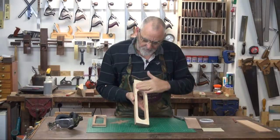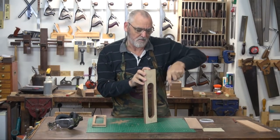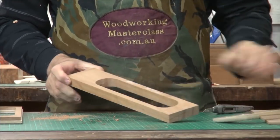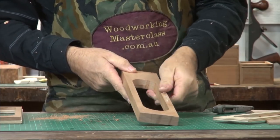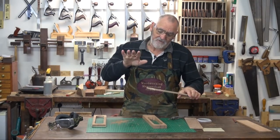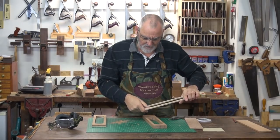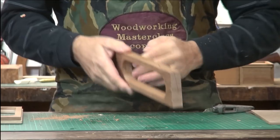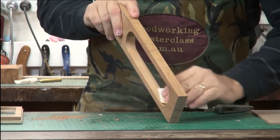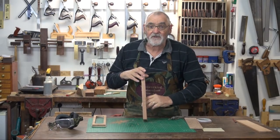And there we have them. Take this smaller template off. Remove any of the glue that's on there, and take the time to clean any glue off the template too, because if you leave it on there it's going to be disastrous when you want to use it next time. At this stage, if you like, you can lightly sand the inside with 180 grit or so if it's not a really nice finish. If it's a good finish, just leave it.